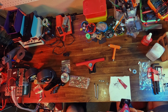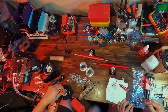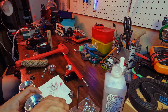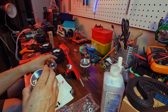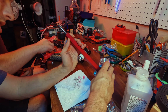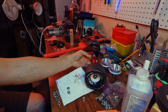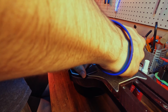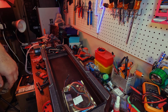In this short time lapse, we're actually putting together the trucks. These are limited edition Boardnamics 180mm trucks with red hangers. They are on the standard base plates, and I believe we picked a 45 front, 33 rear for this one. We're also assembling the pulleys. These are 40-tooth Boardnamics metal pulleys that will interface with the wheels, which you just saw there, that are Mad E-Skate 105s, which he also won at an SD E-Skate event.